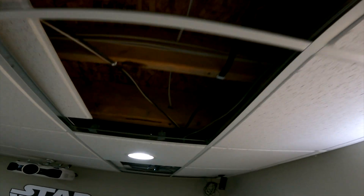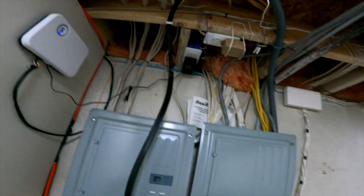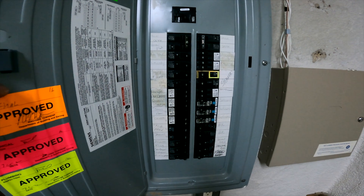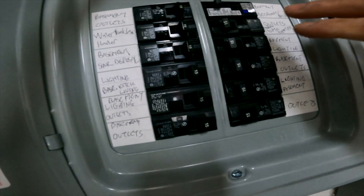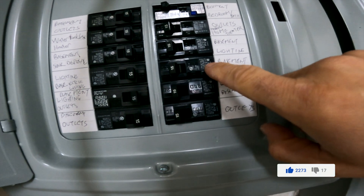You can see my basement — that's where the wire came from. The wire came from the outside, right through all the way. Now I have two panels: one for the main house and one for the basement. My main panel is already full, and the subpanel is already full. So what are we going to do? I'm going to install space savers. We're going to combine breakers — one, two, three, four into two — giving us room for the 60 amp. The displaced breakers are just for outlet lighting, nothing critical.